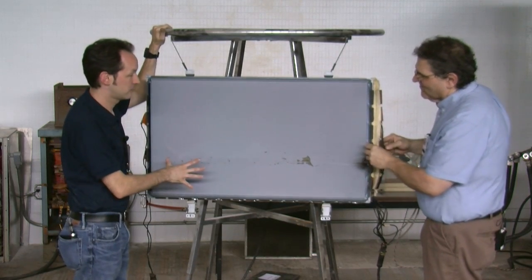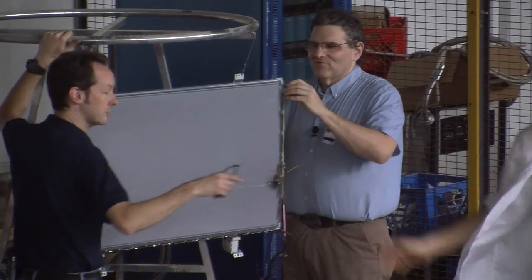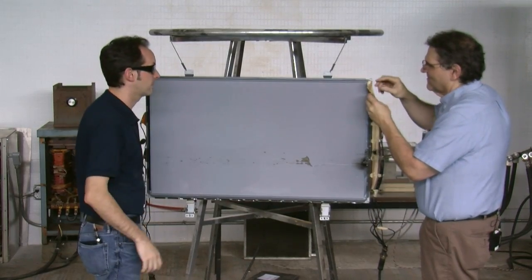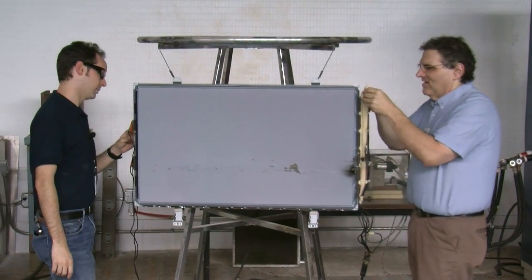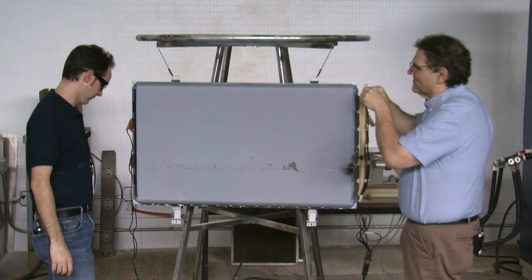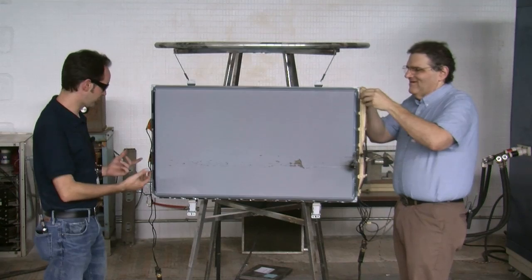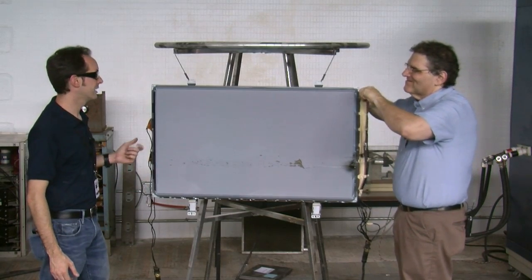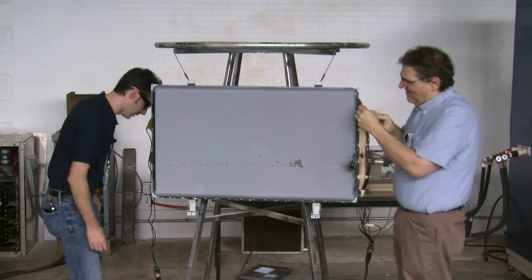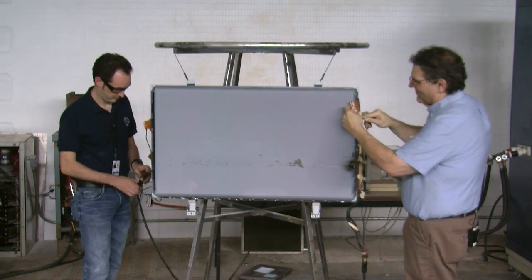So, what happened here and why? The voltage we put across it basically shorted through the width of the display. And it melted the traces on these, which is why we're not getting anything. By the way, it still holds a static charge. It does. It's open circuit so it can't be from the capacitors. But I was like tingle, ooh. The traces that were on here are gone now. They're burned away.